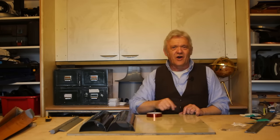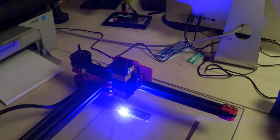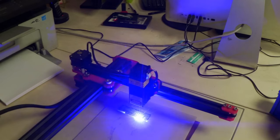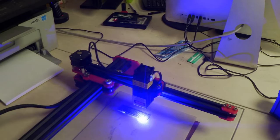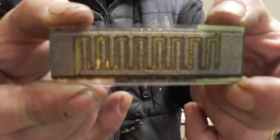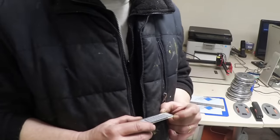You laze it by drawing an interdigitated pattern in your laser program, loading it up, sticking the material underneath the laser, and turning the laser on. What came out of the laser looks really quite impressive — it's got a real graphitic look to it. It has actually formed graphene, a spongy graphene because there's an explosion in there. You can see it looks really graphitic, and the laser has done an awesome job.